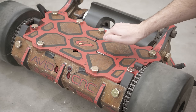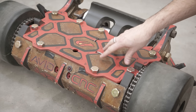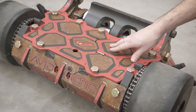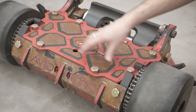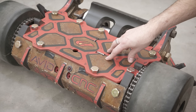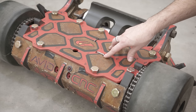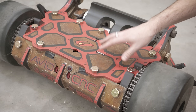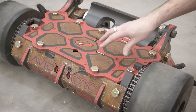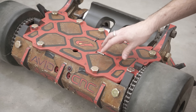Lastly, under the theoretical hood, all of the electronics are fully battle-hardened this year. We didn't do it last year because quite frankly there's a lot of complexities to it, but all of the ESCs were fully opened and a special thermal epoxy was used on the inside, so we shouldn't have any more issues with components getting sheared off and rattled around from the huge hits we're experiencing. All of the electronics have been fully rebuilt and battle-hardened.